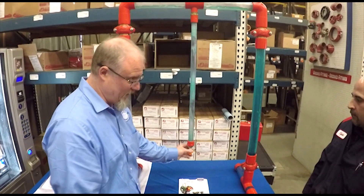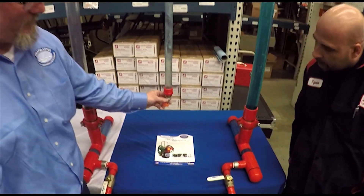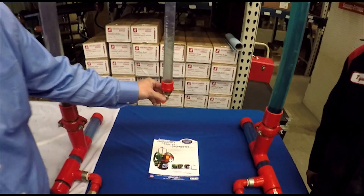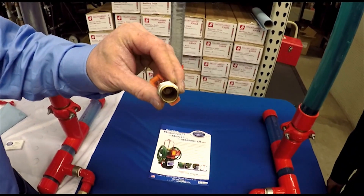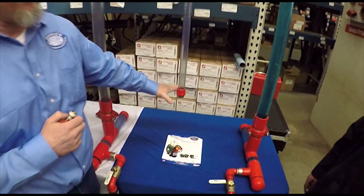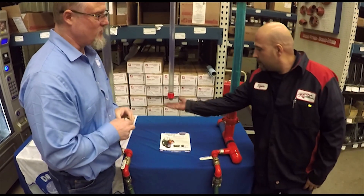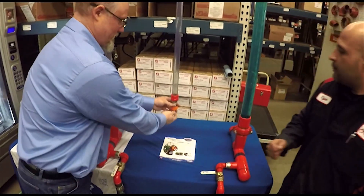You want to feel the head being pulled back in. And then you want to gently tip it to the side. When you tip it to the side, the sprinkler head comes out dry and clean. So there's no mess on your ceiling, nothing on the floor. But best of all, the customers don't smell that black water.